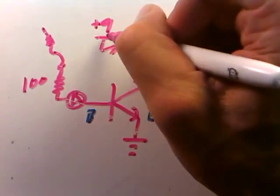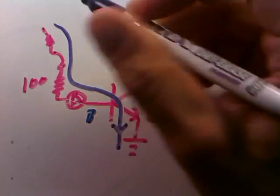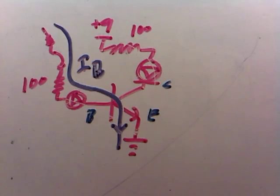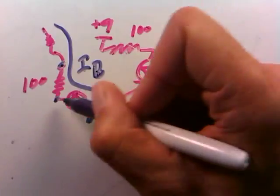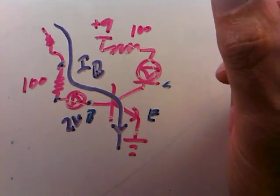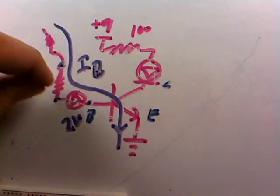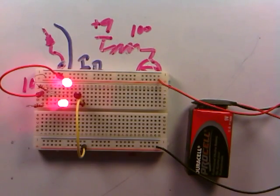Let's make sure we understand why it's turning on. When I connect this lead to 9 volts, a current flows all the way through — that's the base current, probably around 10 milliamps. It's cumbersome to connect meters to these small circuits, but clearly the transistor is turning on. The voltage drop across the resistor plus the LED (about 2 volts for a red LED) still leaves more than 0.6 volts at the base. When I pull this lead and ground it, the transistor turns off.